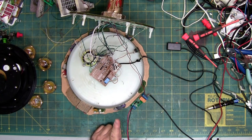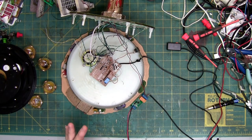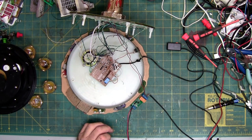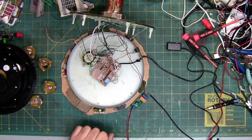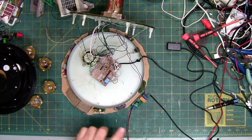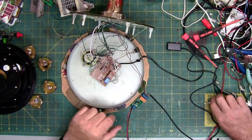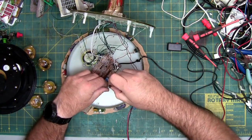This is a very sought-after piece and LEMAX doesn't make spare parts, so making it function for your display would be great. Next step is to cut the wires and mark them off to say which is which, and make sure I figure out which is the hot and which is the negative. I'm assuming the green wire is probably the negative, and that the black, white, and gray are the different positives from the different lighting circuits.